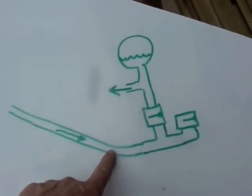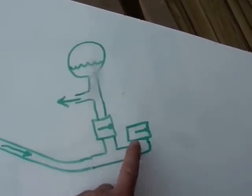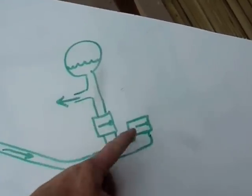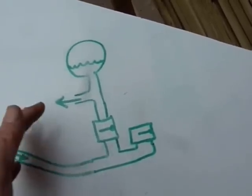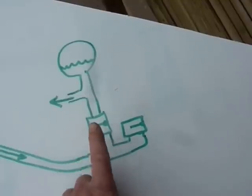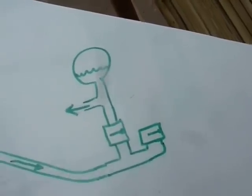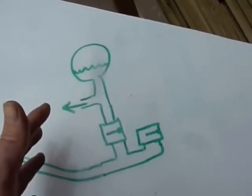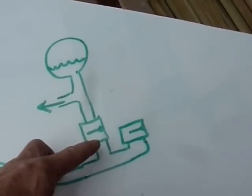Water comes down a slant into the pump. There's a check valve here and a check valve there. The flow on this check valve is that way, so this is running against the check valve. The check valve falls open by gravity, but when the water reaches a certain speed it'll slam that shut. All the water that comes down here has nowhere to go - it wellies down here and causes a pressure wave. It then goes up here past this check valve. So it goes up into here and this check valve prevents it from returning. You get a big pressure wave that builds into this area and is stopped from coming back because of this check valve.